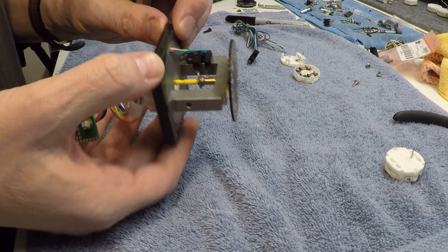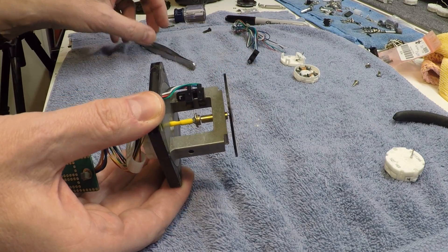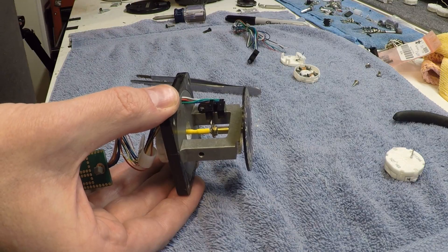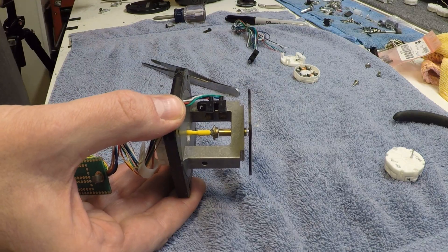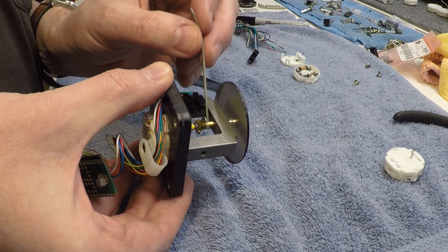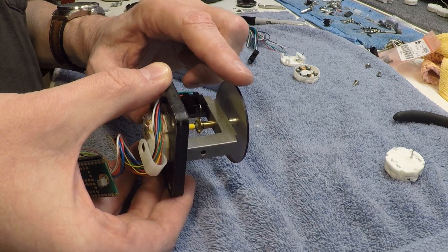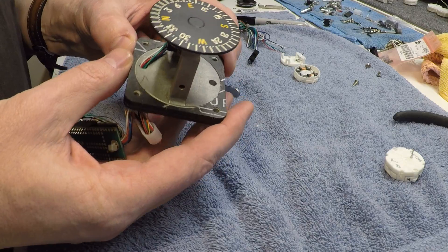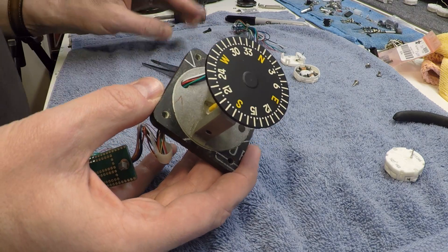On the other side, I've added what I think are called opto-isolators. What happens is when these things sense a break in the light from the transmitter to the receiver, they'll output either a 1 or 0 according to how they're programmed. I've added a little tab here, so that when the compass rotates it'll pass through the sensor and either turn on or off the signal, indicating that it is at a known position. Once you get the compass to a known position, you can slew your compass card to true north, so you have a known starting point.